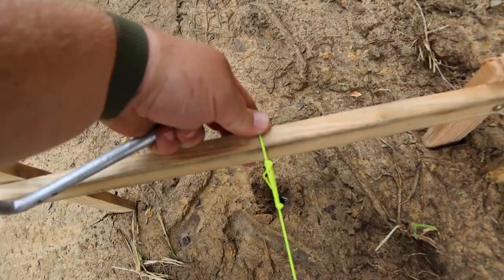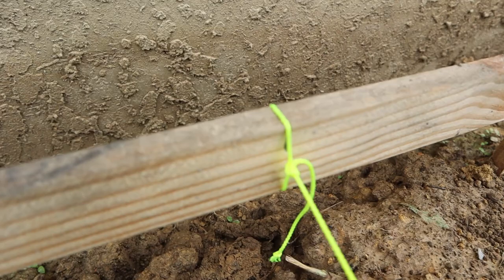The concrete has been sitting for about 8 minutes or so. You wait till it gets kind of firm, and then you put these in. Elijah is holding our string line that's parallel to the house, and Angela is holding the string line that runs perpendicular to the house. So that I've got my crosshairs for this one, and then I've got my middle mark for the middle one. So let's go stick these in real quick. All right, that one's good. That one's good. All right, everybody's right? Yep.